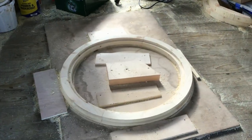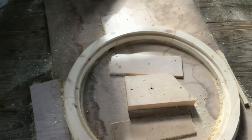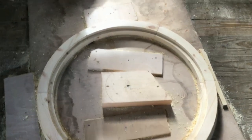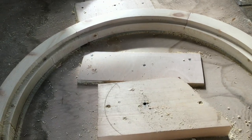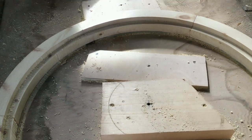So there's a profile now. So you can see the centre ring there, that's where the window will fit. So it's 20mm in width, and the depth is around about 15mm. So that should allow a 6mm window to go in, plus putty either side.